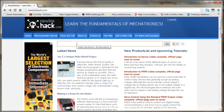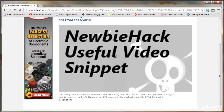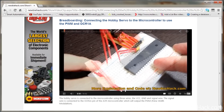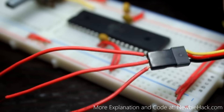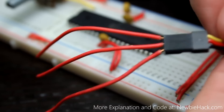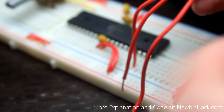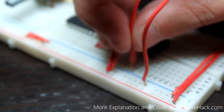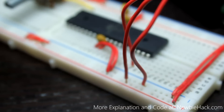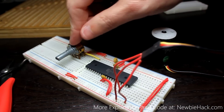Now let's see how to connect a hobby servo. The first one is the one we need. The circuit is very simple. The OCR1A pin is on pin number 19, so the video is telling us to connect the yellow wire to pin number 19. Black obviously goes to ground and the red goes to the power rail. So now we are completely connected to have our servo be controlled by a potentiometer.